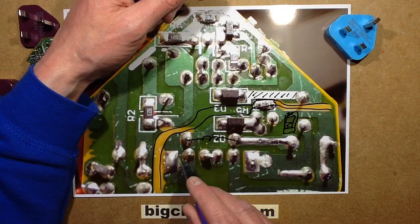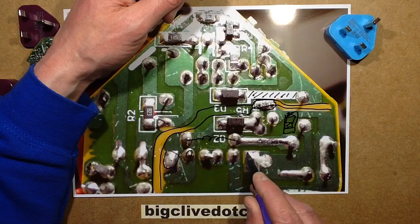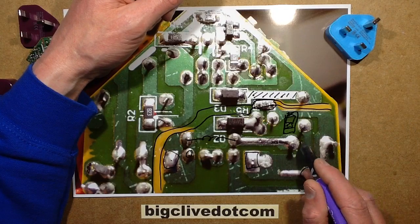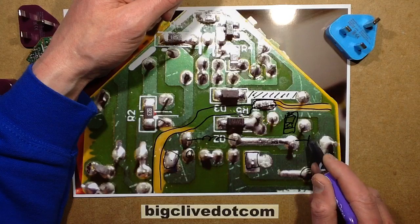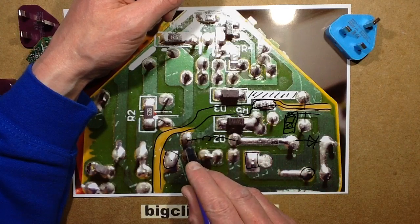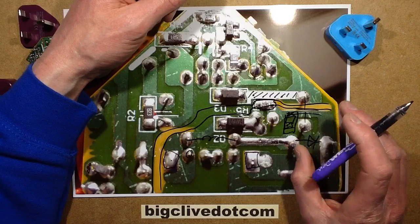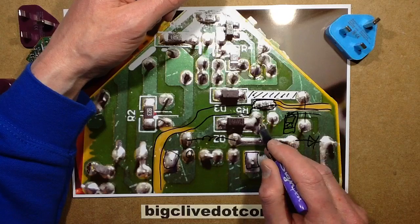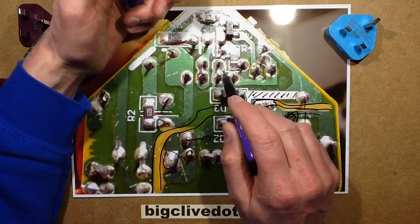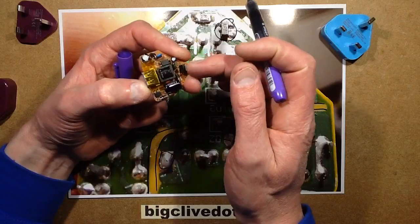The point of that resistor is basically a small load across the opto-isolator to make the voltage feedback stable. The output transformer is between these two pins, and the negative goes straight to the USB port negative pin. That jumps across to that side of the case through the casing itself, then there's a capacitor, a diode, and an interference suppression capacitor. There's also a zener diode connected between the negative and the LED in the optocoupler and the positive supply, so as soon as the voltage reaches about 5 volts it forward biases both the zener and the opto-isolator and sends a signal back to the primary side to stop oscillating. The primary side has a feedback control transistor, a flyback circuit, and a big beefy switching transistor.